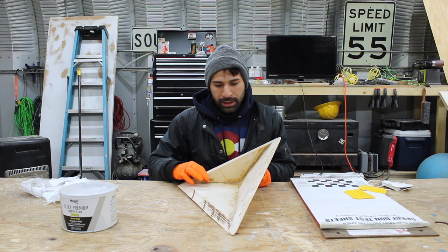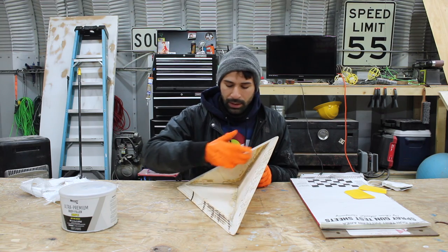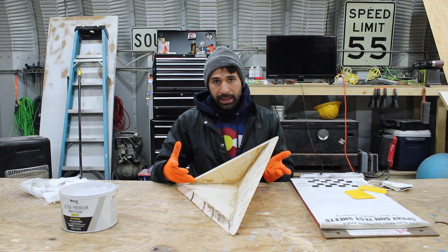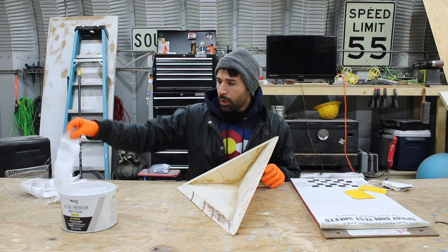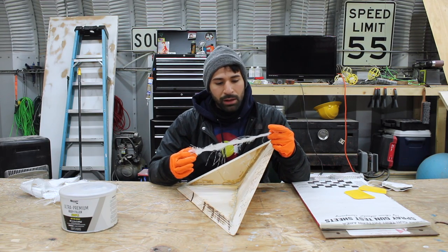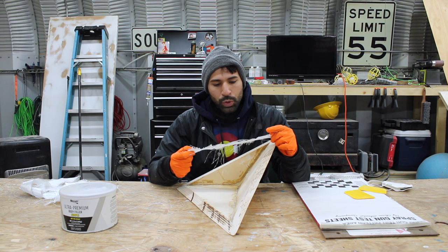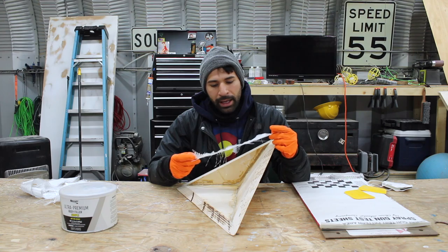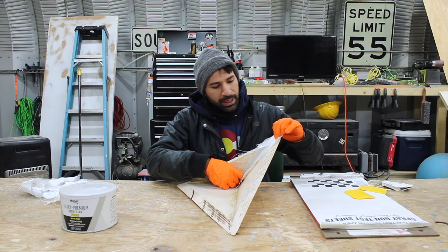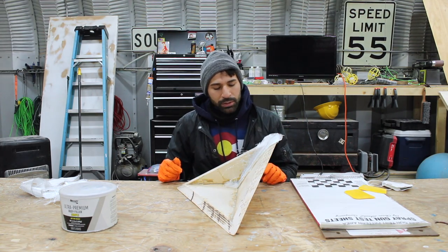Here, the inside of our volume, where we're going to be placing this fiberglass, is on the creases where the joints come together, where the pieces of wood come together. That's where we're going to be adding reinforcement. We have fiberglass cloth here, and this is a weave style fiberglass cloth. We cut it to about 2 inches wide and a little bit longer than the actual crease itself, just to give us some working room there. So that's what it is going to look like.